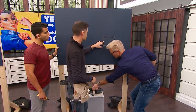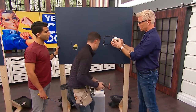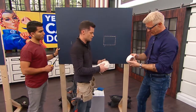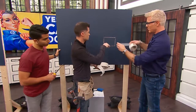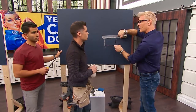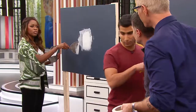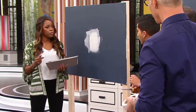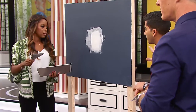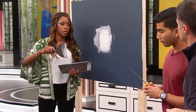Now we can do the same technique as we did on the small patch. Apply adhesive tape or flat tape over the seams, then put some mud over it. How are you doing on the mud? I think I'm doing pretty good. Would I have to sand this down? Yeah, give it a light sand, then you can paint the wall. That's your first coat — let it dry overnight, hit it with a second coat and maybe even a third.